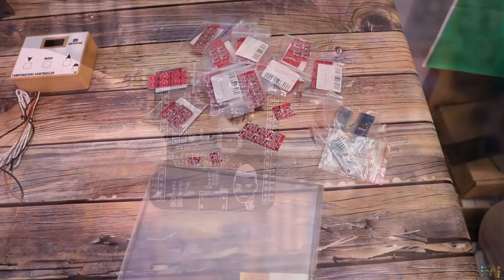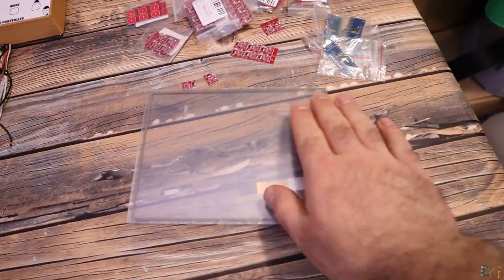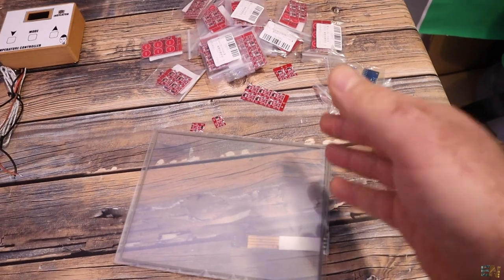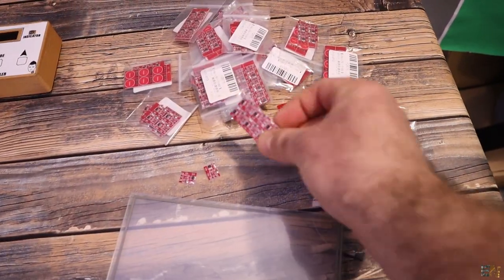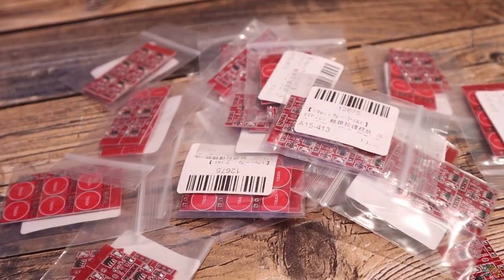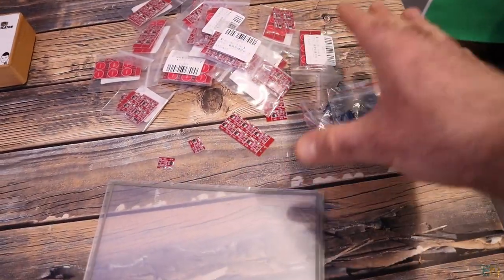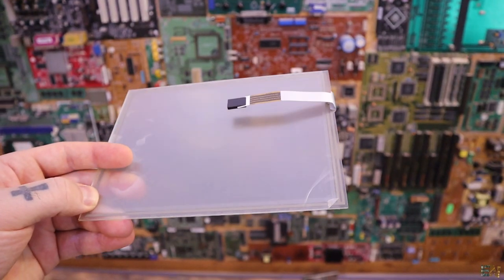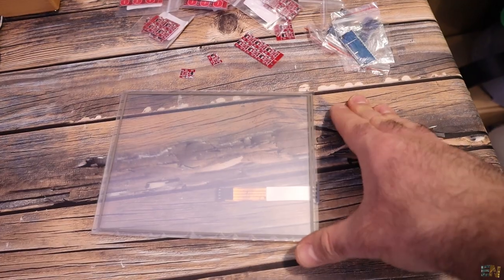Another project will be something I'll call a PID touch plate. I want to place a metal ball, touch and sense its position, and move it wherever I want using PID control — just like we did with the ping pong ball, but that was 1D and this would be 2D. I want to use very small capacitive sensors — I have about 200 of them — and create my own table. I'll use multiplexers to handle the output from those 200 sensors and connect them to an Arduino. If that doesn't work, I also have a resistive screen where the resistance changes depending on the touch position.